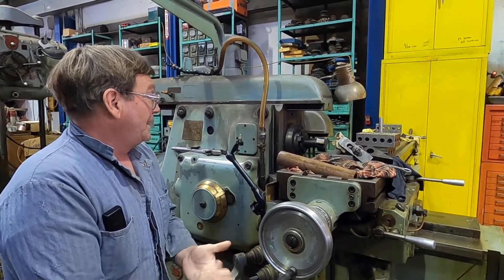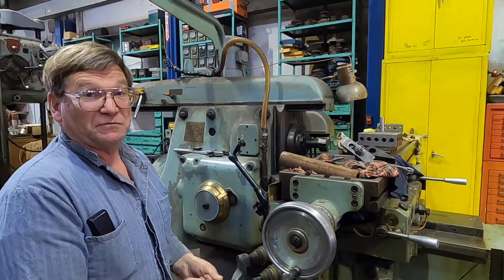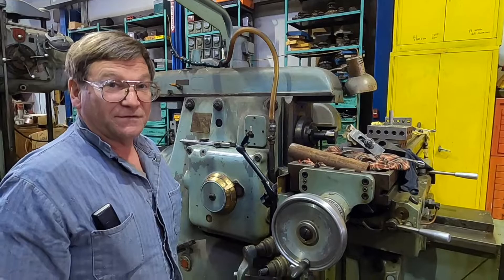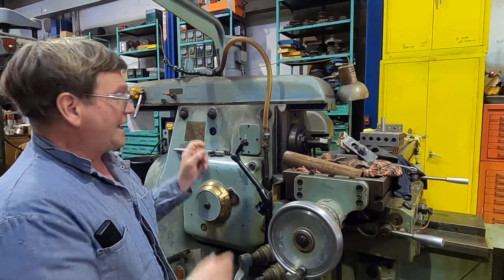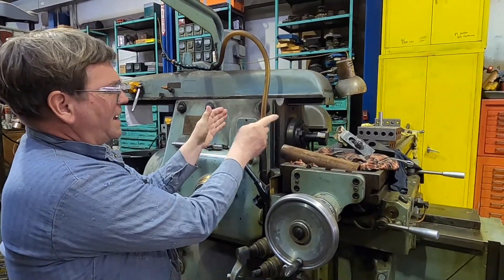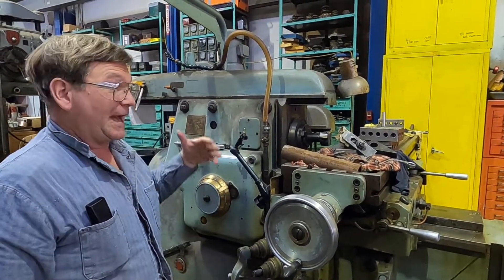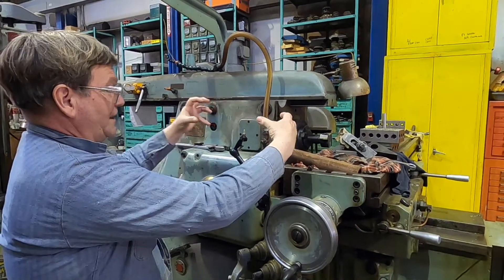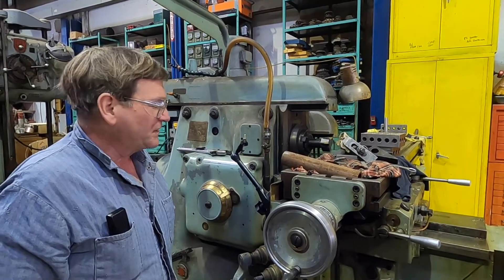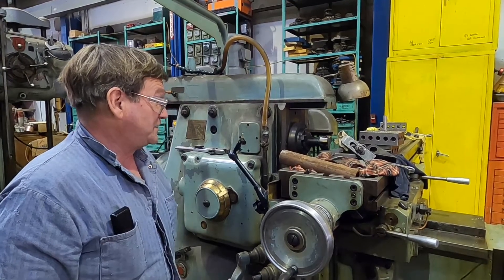Even a lot of new holders aren't that perfect. I would have liked it to be better, but it wasn't run-out that we had — that was a portion of the spindle that was not getting contact. As far as run-out goes, we had zero run-out with an indicator; it was showing that it was perfect. We had an area in the front with good contact and an area in the back with good contact, but a middle area with about four to five ten-thousandths of a gap. It shouldn't be a problem, and it's not being a problem.